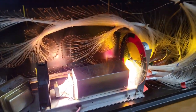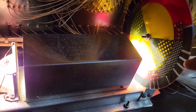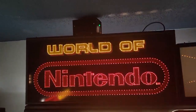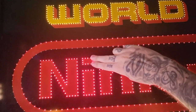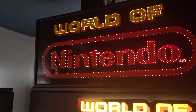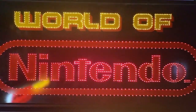So this is the inside of the World of Nintendo sign. There's a light bulb here that shines all the light through this metal box, which goes through a rotating color wheel, which goes into these bundles of fibers at the ends. The repair went really smooth — I'm really happy with how everything turned out. The only issue is that these two that were out of sequence in the letter I, when you look from a side view they don't really appear to be on, but when you look at it dead on it illuminates properly, and that's what matters most.